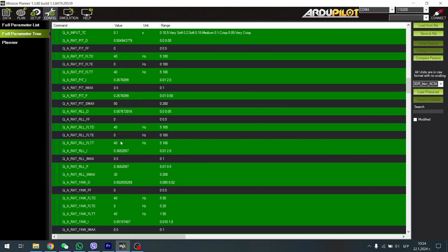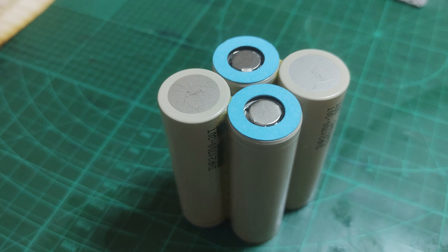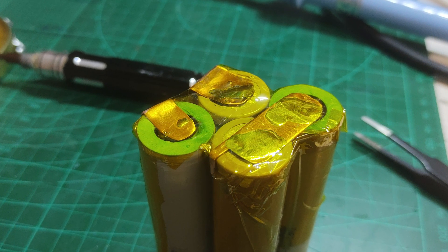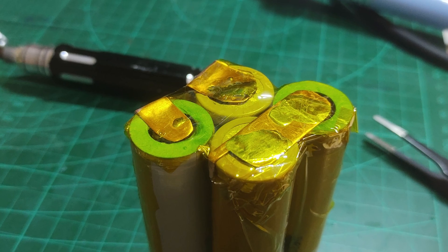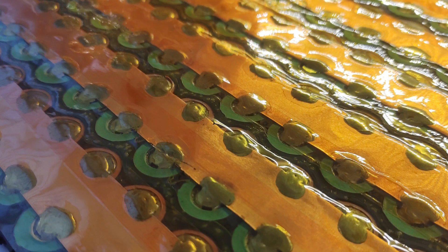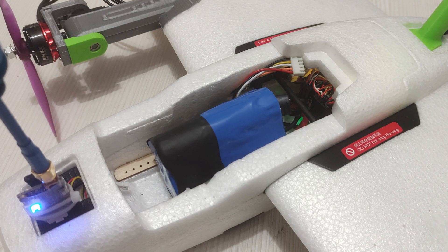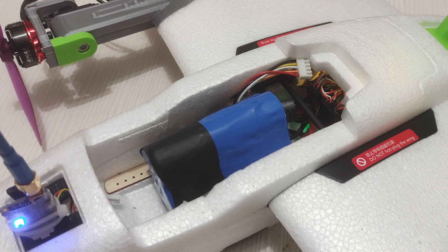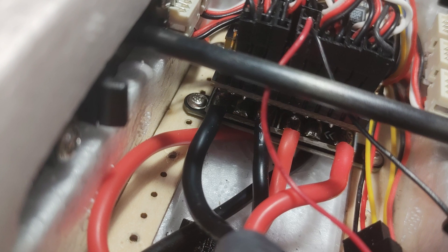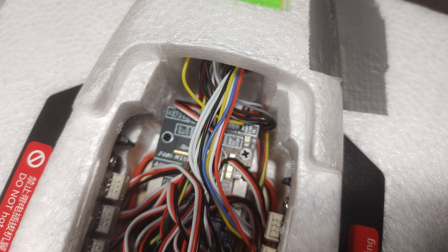The last thing I needed to tackle was the battery. Since I had mistakenly ordered some 3000mAh 35A discharge Samsung cells I decided to finally put those to good use and make a battery for the T1 out of them. I used 0.3mm copper strip and soldering as opposed to spot welding, because lately that is how I've been building all my lithium-ion batteries, and with the technique I've developed there haven't been any issues with overheating the cells — and this latest technique makes things much easier for me too. The battery turned out weirdly shaped, but that was the only way to get it to fit in the Ranger without having to dig up foam from the bottom of the plane, although I did have to cut some foam off the canopy. I also had to redo some wiring between the flight controller and the Ranger's power distribution board, and remove some foam from the back of the fuselage on the inside so I could move the flight controller as far back as possible for CG's sake.